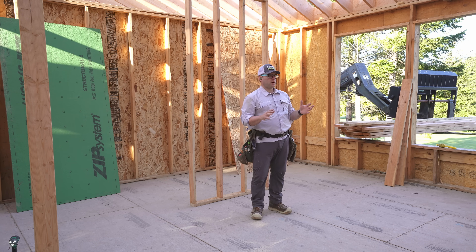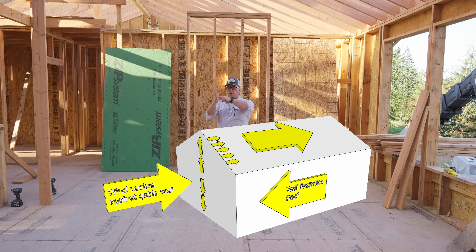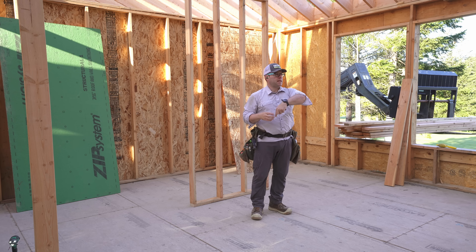When it comes to the force from wind, think of wind coming perpendicular to the building. In order for that wall not to just cave in, the shear walls on either side, the roof, and even the floor system help to distribute that into shear walls and down. Now, wind loads can actually go up before coming down. With earthquake loads, what we're really trying to do is prevent three different things from happening.